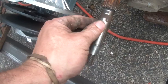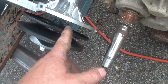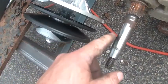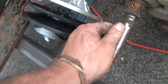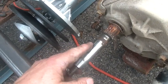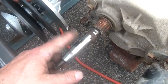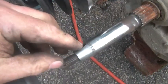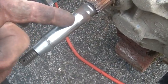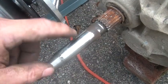This appears to be a three-quarter inch shaft. I ordered — I think they're both 12s. That'll get me a hookup here. I'm going to have to cut a keyway — I'll just take the grinder and very carefully cut a keyway in for that to go. Then I'm going to chain drive it, and if I want to change the gear ratio I could just get a bigger sprocket back here.